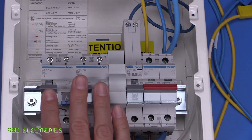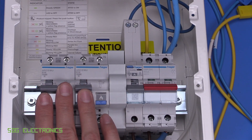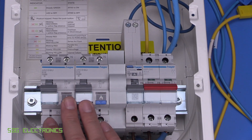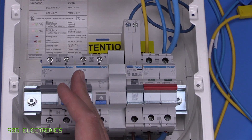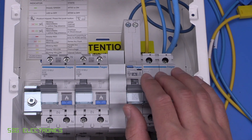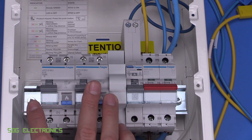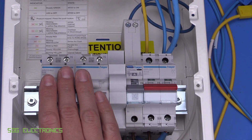These ones don't have any RCD protection and there doesn't seem to be any standard way to incorporate these into a UK domestic consumer unit, because you need RCD protection on all new circuits. That either means you have to install another RCBO like I have done, or you need a standalone RCD and maybe protect multiple circuits with that. Some people don't like that. Either way, you end up taking at least three units on your DIN rail for this functionality.